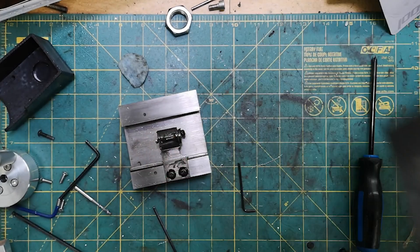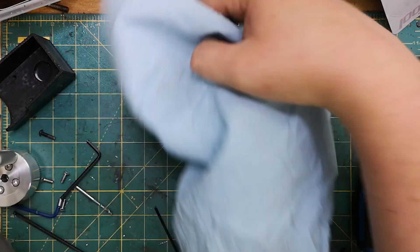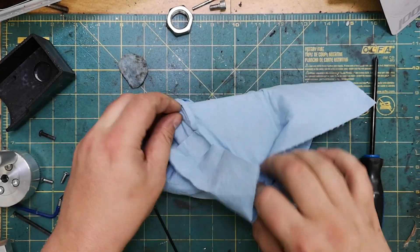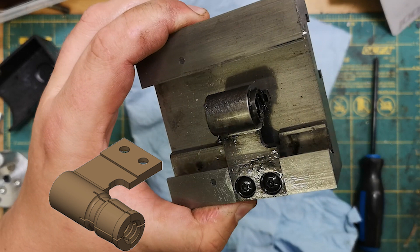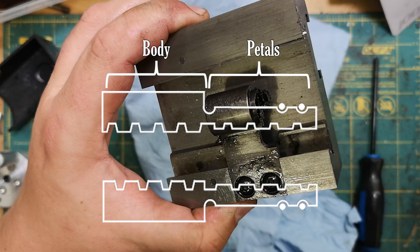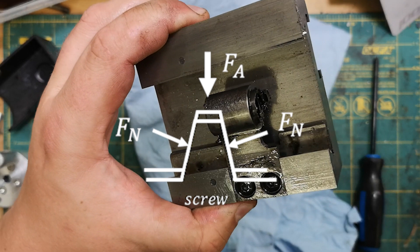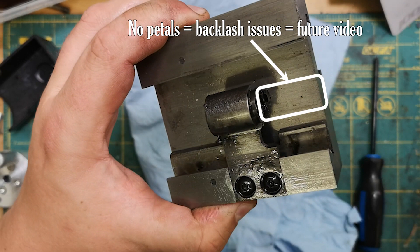You can also see how the nut actually enters from the side of the dovetail. Once I wipe off a little bit of the dirt and oil, we can have a closer look at the broken nut. The nut used to be a petal-type nut, or at least that's what I'm calling it — it's a pretty good option for precision and wear compensation, unfortunately they don't tend to be that strong. The nut is comprised of two main sections: the body, and then the petals, normally four of them. The petals are on a smaller diameter than the body and are slit into sections, usually four. There are garter springs that force the petals to constrict radially onto the screw, but the petals remain stiff along the axis of the screw. When there's clearance at the roots, the thread forms pushing together eliminates the clearance between the faces. As the screw wears, the garter springs continue to push in and compensate. The petals have broken off the nut on my lathe, which means no backlash prevention for me.